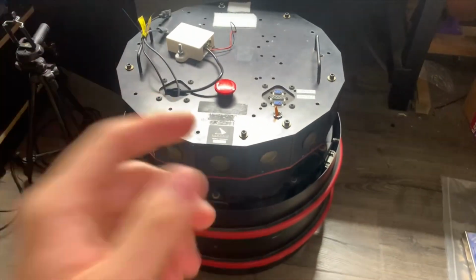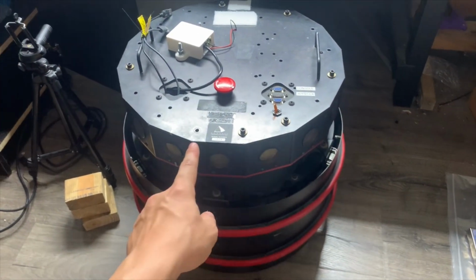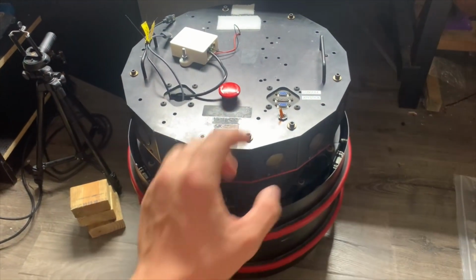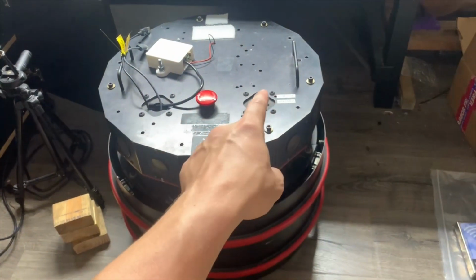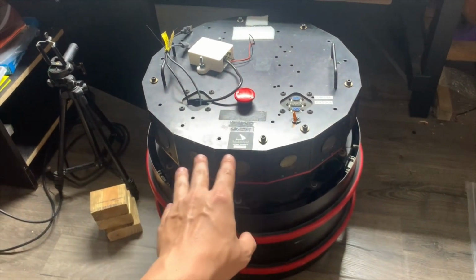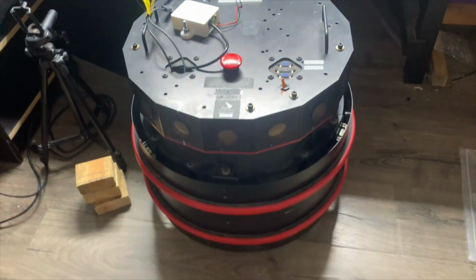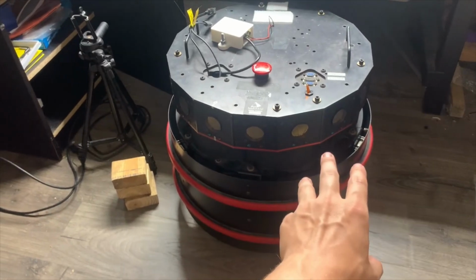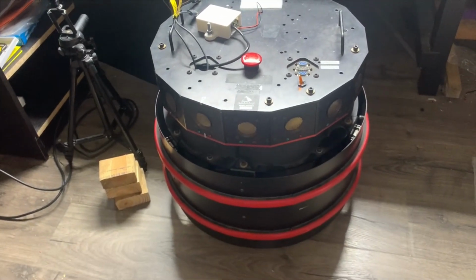In this video, I'm going to be restoring functionality to those. That's my main goal, and I'm gonna add some wireless connectivity so that I can control it without plugging in my PlayStation controller, and hopefully be able to avoid some obstacles and follow a path using only the ultrasonic sonars, plus dead reckoning from the encoders in the steering and the drive motors.